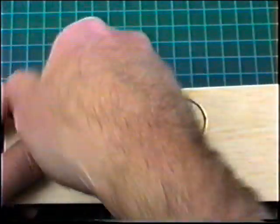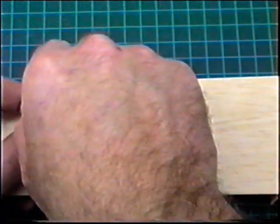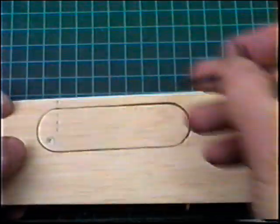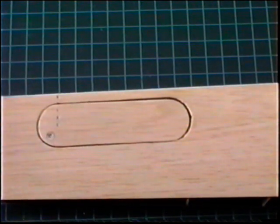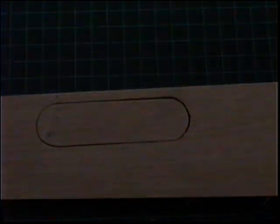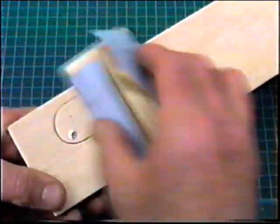Both Joe and I have used this on the Spitfires, and so far it's proven to be just about the nicest way I've ever seen to make a hatch. One aluminum screw, one blind nut, maybe an hour of labor, and you have adjustable controls now for the life of the airplane. Now with the hatch in place, you do a flash, it's usually just a couple of swipes of sandpaper and you got it right back.